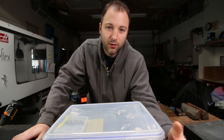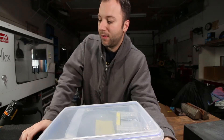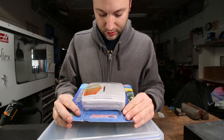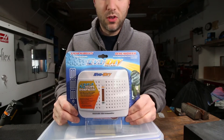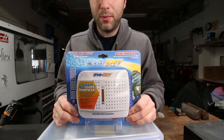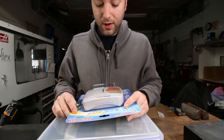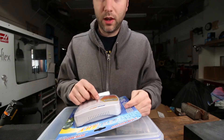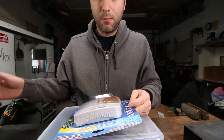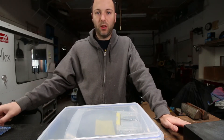A lot of filament manufacturers that produce nylon recommend using a dry box. They also recommend using some form of desiccant to keep it dry. This here is an Evadry — I use them a lot. I use them inside the actual enclosure for the 3D printer. All my filament is stored with these. They're quite affordable, and the neat thing is they're easily rechargeable by plugging them into the wall. They have an internal heating element that heats up and boils off all the water, and then you can continue using them to keep your filament dry.